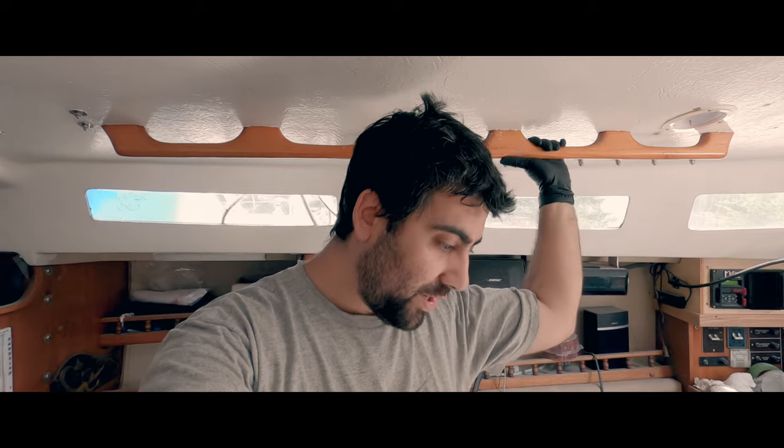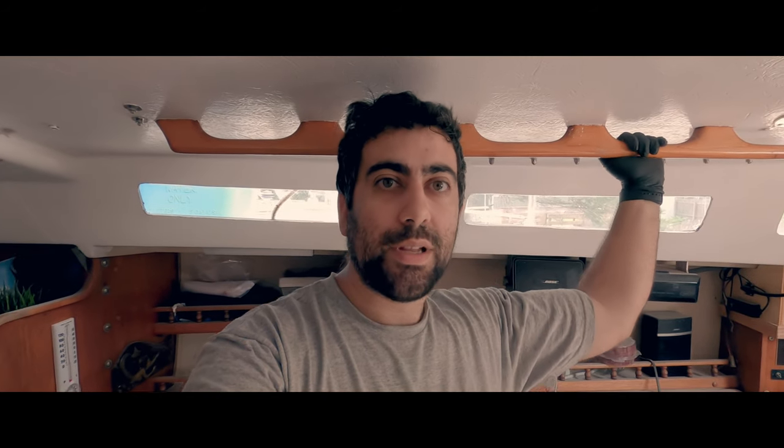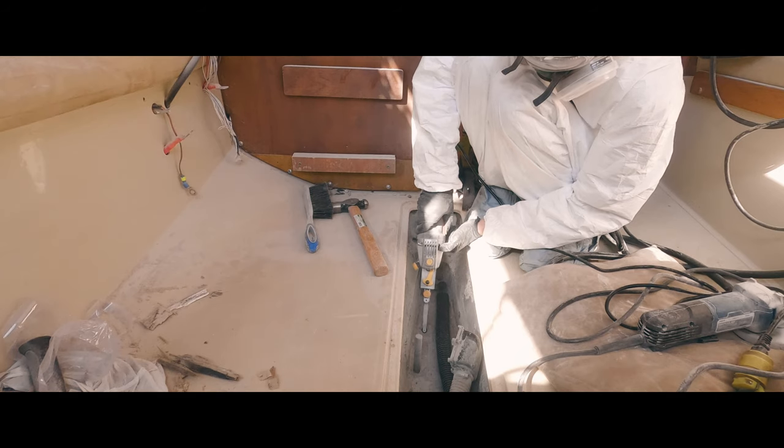I found a crack that wasn't really repaired properly. It was from previous damage. And I know it's previous because the cracks are a little black, and that's usually indicative of longer term water moisture. So we're going to grind those out and fill them in as we do the repair. Today, mainly, we are going to strip the rest of the gel coat that's all over the bilge, get it cleaned up and ready to template and fiberglass tomorrow.